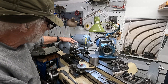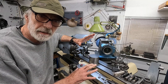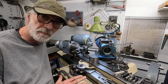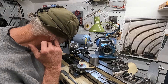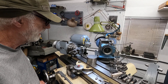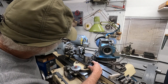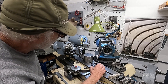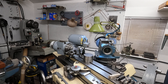Now, to prepare the machine, you want to lubricate it, but you want to run this y-axis back and forth a few times to get it lubricated good, so you can reduce the stick-slip. So I'm going to run her back. I just roughly set a little surface gauge up with the work there, and I've got it roughly set up to center the wheel. I'm going to get that out of the way.